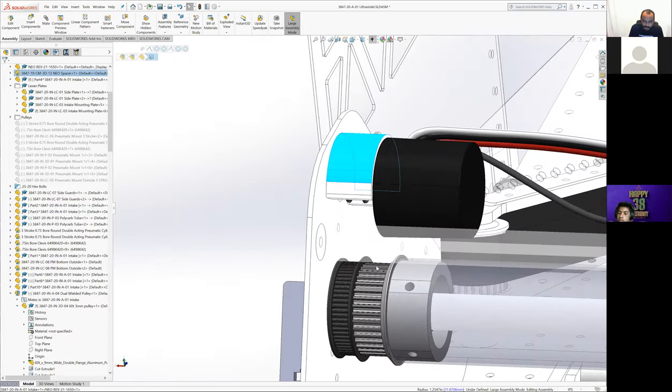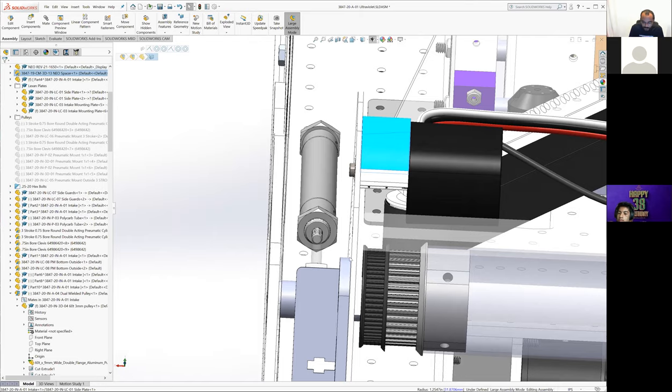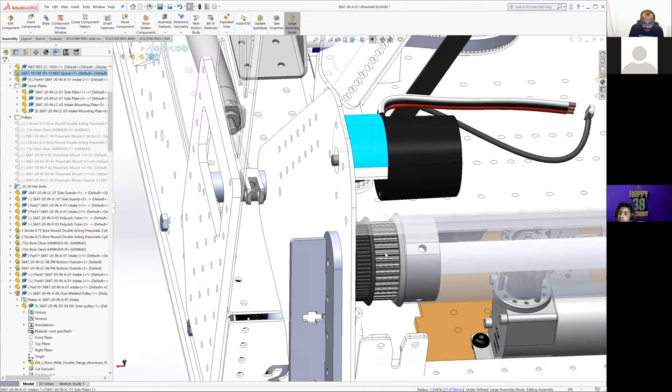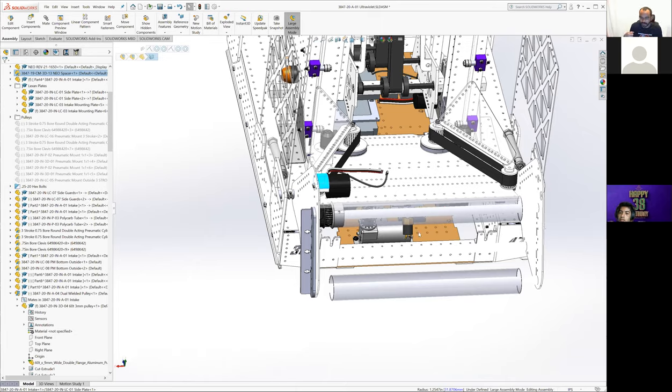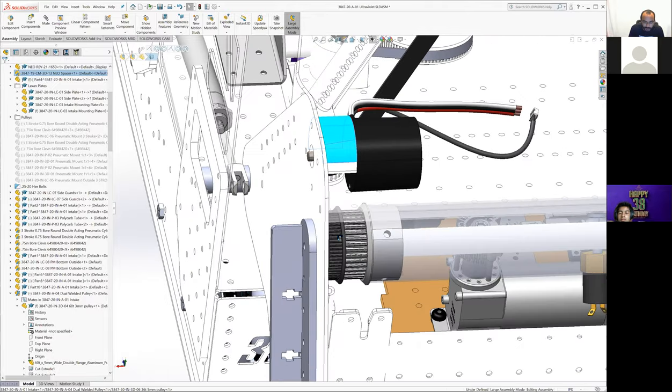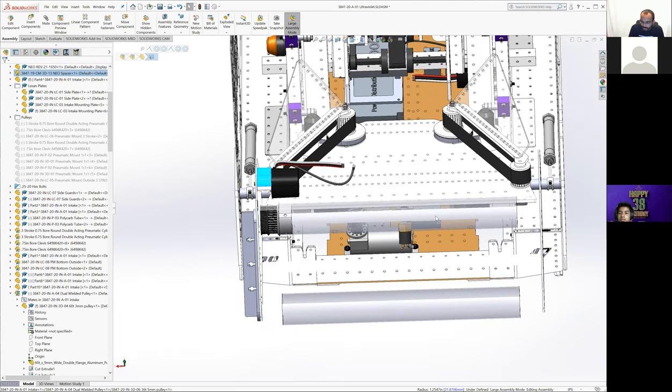So a lot of teams who are going to use hex shafts and things will need the Neo mounted here, then you have another sheet to support things, or you have the hex shaft going through and the pulleys on the outside. And that just ends up being heavier and more complicated than what we like to be able to do, right? So with our setup currently, if we need to take one of these rollers out, all we're doing is unbolting two things and the roller comes out, instead of having to slide hex shafts through bearings and locate everything and retighten things down with shaft collars or snap rings or anything like that. There are little push-on retaining rings on the ends of these rollers that hold the entire roller assembly together. So if we do unbolt it, nothing slides off. There aren't spacers or anything. None of that exists in here to complicate anything.